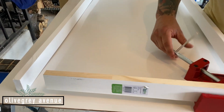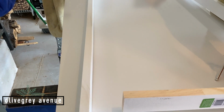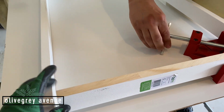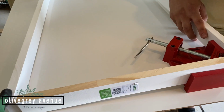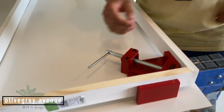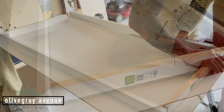All of our pieces cut down. This is actually a PVC type material. I would recommend using that all the way around. We're actually using scraps. So these sides are wood, but this will be good because it's plastic and none of the concrete will absorb into it. And so now we're gonna build the box by drilling these pieces together and then we will attach the box to this melamine board and then we'll go to the next step.